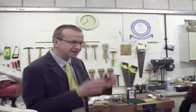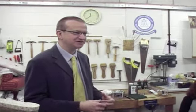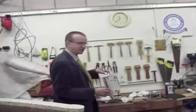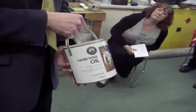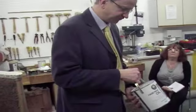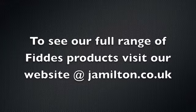A customer mentions they have a wooden board they've never treated, and they want water resistance, a nice colour, and it has some stains and marks. They'd like an oak, natural colour, and they use it for food preparation. The best product for that is hard wax oil — it's a blend of different oils. It's toy safe, food safe, water resistant, and heat resistant, so it's brilliant in the kitchen. It doesn't matter if you prepare food on it because it's passed a safety test. All these products are food safe and child safe when dry, making hard wax oil perfect for kitchen surfaces.